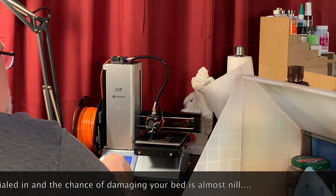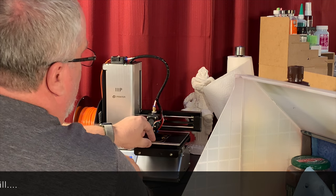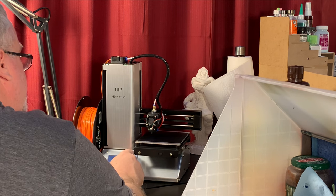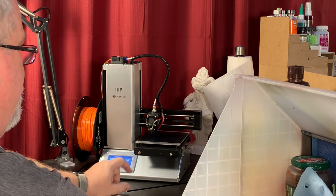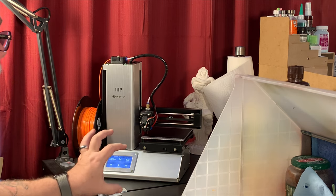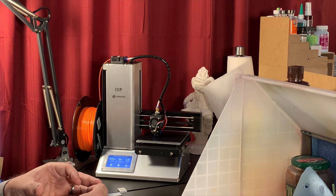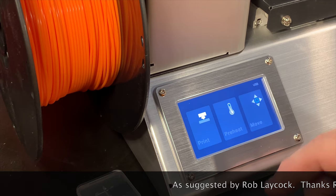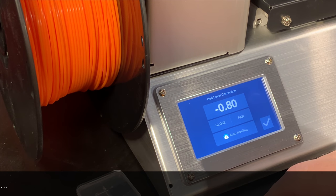Preheat — keep the nozzle warm. I'm doing the exact same print each time so that if there are any changes, it'll be because of the printer, not because of the file. This is a tedious way to do it, but it's a very, very safe way to dial yourself in. Another way is you can set up a model — maybe just a block or a circle — and give it a massively giant skirt. As it's printing, you can adjust the tune on the fly, inching in closer and closer until the skirt starts to print the way it's supposed to.